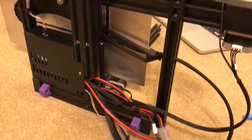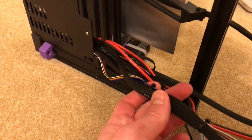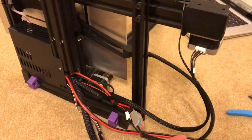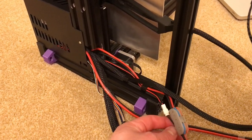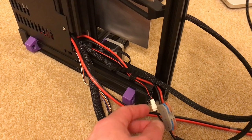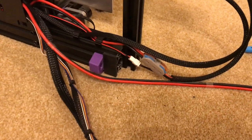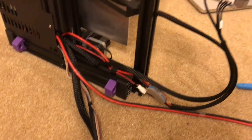I've got it all wired up and I'm doing cable management now. The screen cable is zip-tied up here, and I'm organizing cables that go to the same places and securing them to the frame wherever it makes sense. For the bed heater cable and thermistor cable, I want to make a bracket to hold the big connector. I might just cut it out and solder the wires together with heat shrink to get it out of the way - this seems like a hazard as the bed moves back and forth since that stiff connector in the middle of the wire will be a point of fatigue.